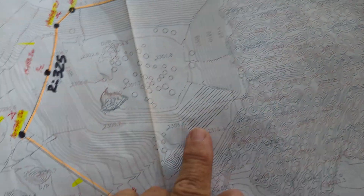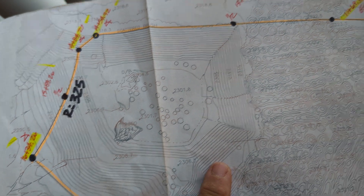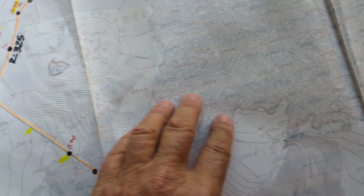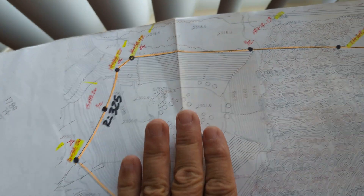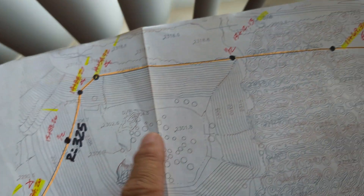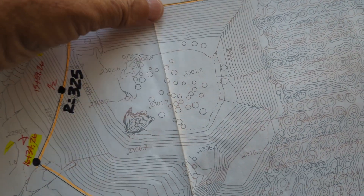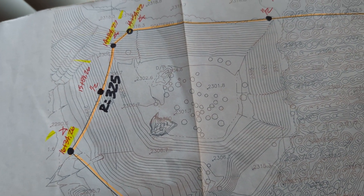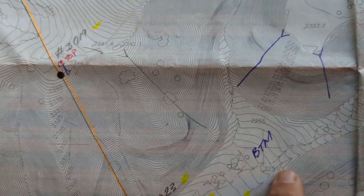If we were having to stake this slope - this basin has already been built - what you would see on a grading plan is the natural contours in a lighter color, and what's to be built in a darker color, so you can see where the top is going to blend in with the natural ground. You can identify this as a man-made slope because it's probably at a two-to-one. You can lay a scale down and see how uniform it is, as opposed to natural terrain.